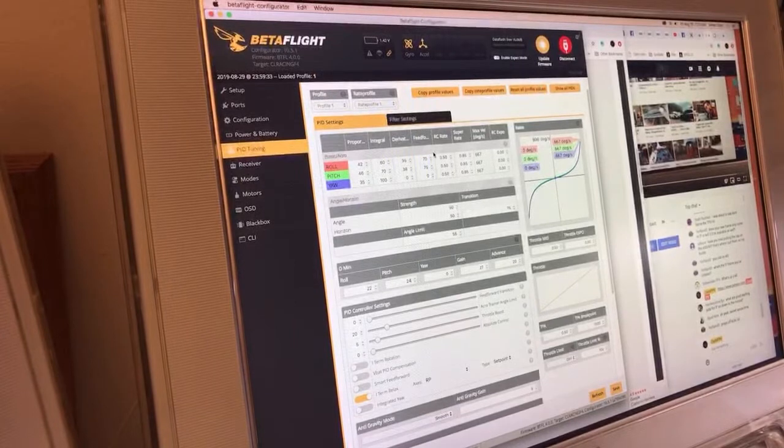So if you look at your setup and think, okay, how is my weight distributed differently? You can get an idea for what you want to do with pitch and roll. Pitch and roll are the biggest ones that I'm thinking about, right? These are based around an alien style 5-inch rig with a GoPro up front and a big battery on the top.